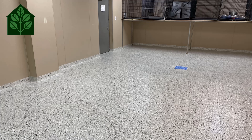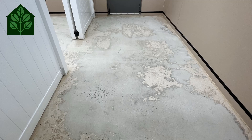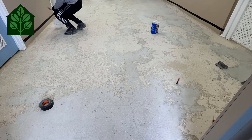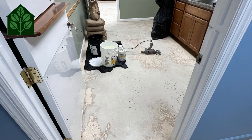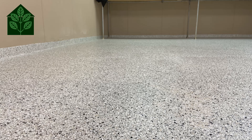The second type of animal care flooring that we install is a four-coat flake flooring system. Like with all of our installations, we begin with diamond grinding the substrate to remove any tile glaze or surface contaminants and to establish a mechanical profile. Using hand grinders and flap wheels, we abrade all edges at wall-to-floor joints to ensure adequate prep and profile. We vacuum and do our solvent wipe to ensure all loose debris is removed, and we tape all of our terminations and apply our four-inch cove base to all floor-to-wall joints.